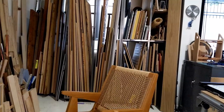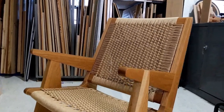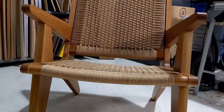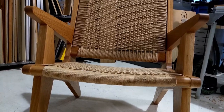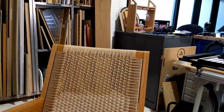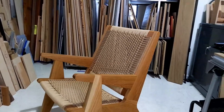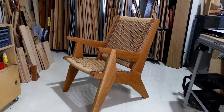We've made a lot of chairs before here at Shaper headquarters. The two big things that are new for this one are the Danish cord upholstery, which gives it a little bit of give, and the curved stretcher. When you do plywood furniture, you get a lot of really straight lines, and those straight lines are not comfortable for the backs of your knees. Jake and I decided to take it an extra step and put a curve in that front profile — and the same thing on the back — giving a little extra ergonomics for the backs of your legs. You would not believe how much more comfortable this chair is than anything else we've built before.